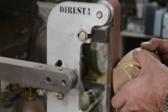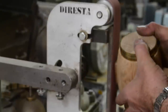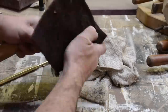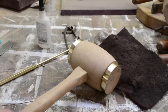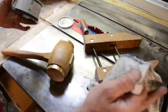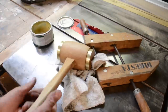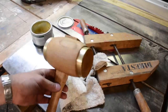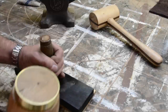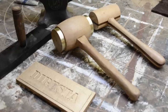This is the type of mallet you'd use for mortising and stuff like that - those brass rings would put dents in wood if you were planning on banging onto it, but it's really just a chisel mallet. I put a little convex on the end of the top of the handle just to make it fit with the football shape. I'm using Scotch-Brite to clean up the rings and get the sharp edge off. I'm proud of my work - I'm using Briwax just to seal it and keep my fingerprints off it. I was really not sure what to expect; I had a vision and I was able to hit it right on the mark, and that doesn't happen every time. This is just paying homage to an old movie logo, and there's my mark and there's my mallet - thanks for watching.